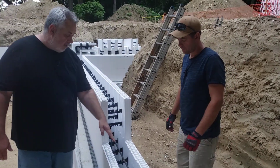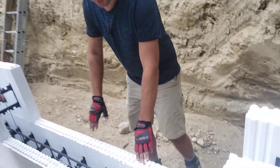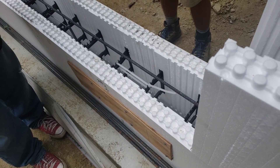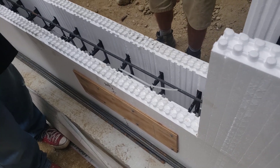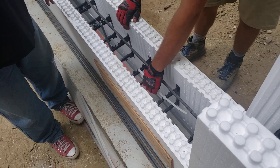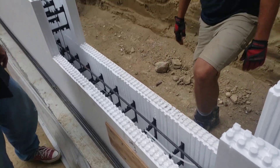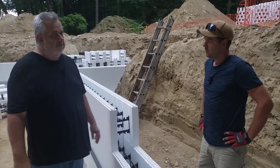I noticed that we have metal ties, but there's a zip tie over here — why did we switch? This right here is the common seam, which we discussed earlier. It's connected by the plywood corners and we work from our corners to one area, choosing to place it closer to the corner so we can put one brace here and another staggered. Basically this seam area is too big for the vertical clip, so we use zip ties here to tie them together and give that extra reinforcement. It's a pretty neat system — it's pretty rigid, and once you get concrete in there, this is going nowhere.